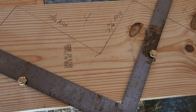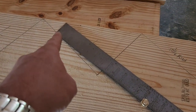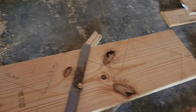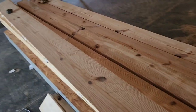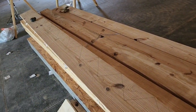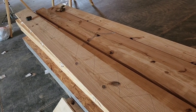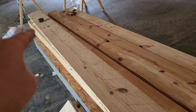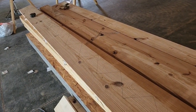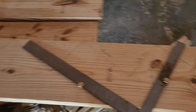Now let me show you how to lay it out on the board. Just use a stair calculator and I'll show you a quick easy way to do this. First thing: get yourself a 2x12. You need to make sure it's long enough — this is going to be a long set of stairs. I went with a 2x12x16, which put me just right to reduce as much waste as possible. You may have to go with a 20 depending on the length of your staircase.